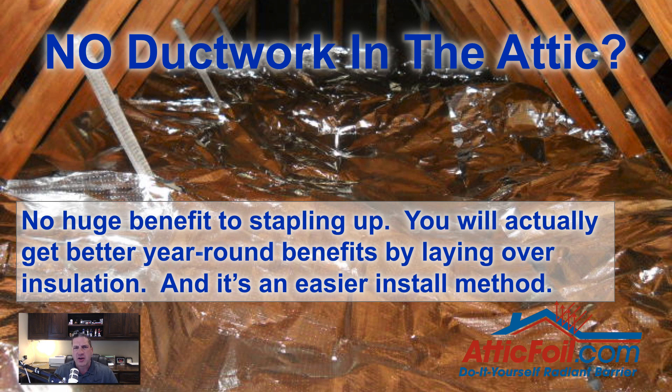Some people ask, won't that make my attic really hot? People tend to get hung up about the air temperature inside the attic. The attic may be a little hotter, but I really don't care that much about attic temperature — I care about insulation temperature. If I get in my car on a hot, sunny day, I'm not worried about the air temperature. I'm worried about the seat temperature, the dashboard temperature, and the steering wheel temperature. That's what makes the car hot. I can turn the air conditioner on and in a couple of minutes the air will cool down, but the seats and the dashboard have the thermal mass that keeps it hot. Same thing with your attic — we want to keep the insulation cooler.